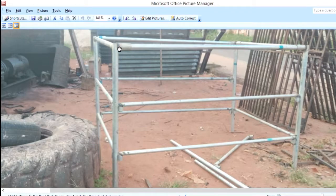You can see this short piece here — he cut it out and welded it onto the stand, so that a smaller pipe with a smaller diameter can fit into the 1.5-inch pipe. We then went for something a bit lower than 1.5 inches, which is 1.25 inches, and it worked very well. We bought a length of 1.5-inch pipe for 2,900, and a length of 1.25-inch pipe for 2,800.